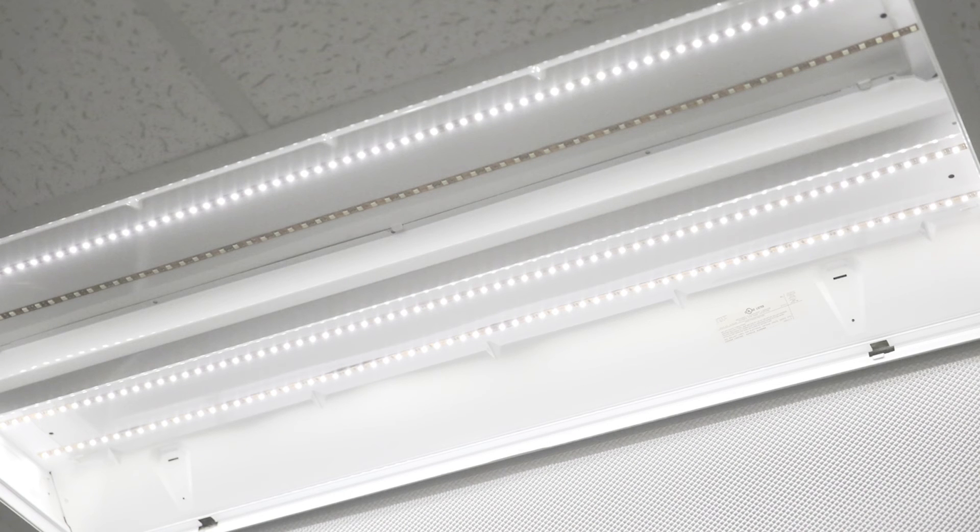For some troubleshooting: if your LED retrofit ever turns off, check to see that your wires are properly connected and that your power supply is also properly connected to the AC line. If you ever see a strip hanging, this is due to not properly securing it, and you'll need to add some silicone or reattach some adhesive tape.